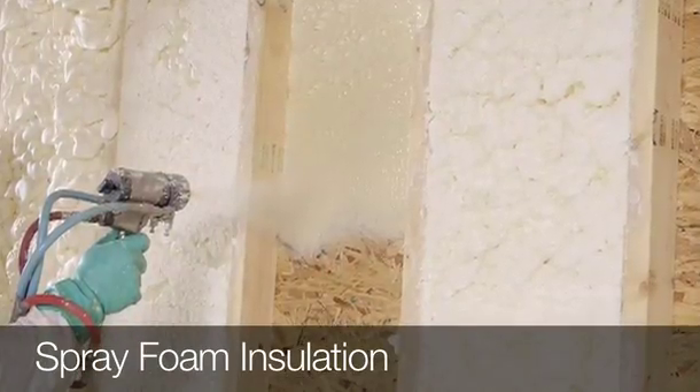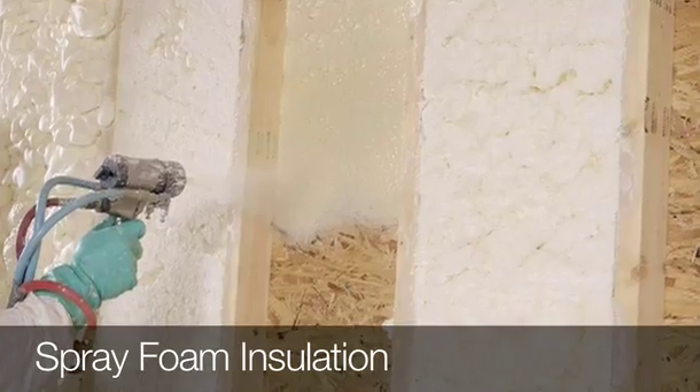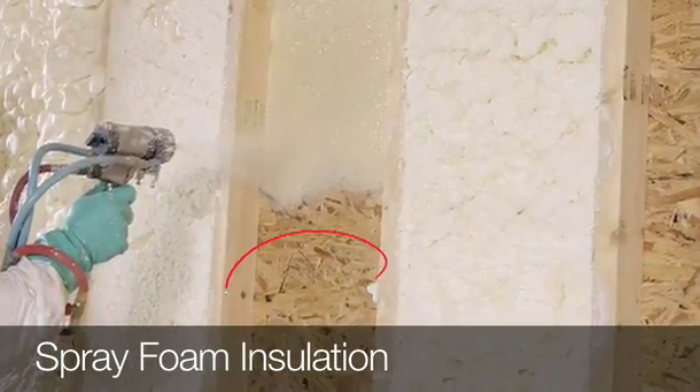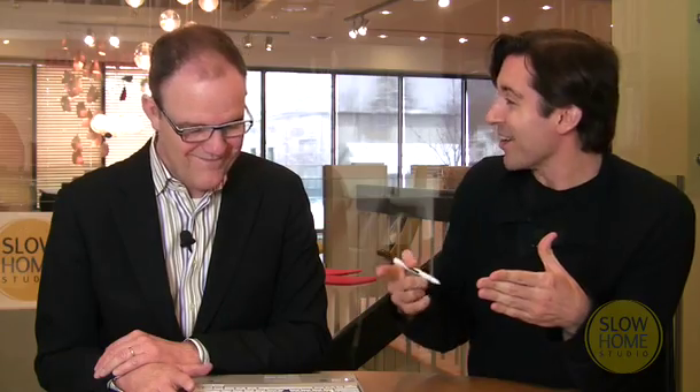You can go another level, which is spray foam. We talked about this a few weeks ago. The thing about spray foam is it really fills the cavity, so you're going to have a lot of sound resistance. The thing is, you have to add backing because on an interior wall there's no sheeting, so you'll need to put temporary backing to hold the spray foam in place.